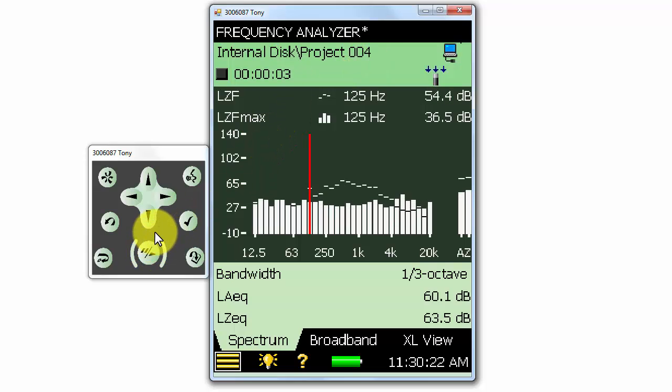When we make measurements, it's a good idea to take notes about what the measurement is. The button at the top right is the audio commentary button and can make note taking very easy. When we hold down the button, we can make an audio note that is saved with the measurement. The audio comments are useful for easily identifying the measurement in the future. Notice that when I hold down the commentary button, we see the button icon on the display screen, and when I release the button, the commentary icon goes away.